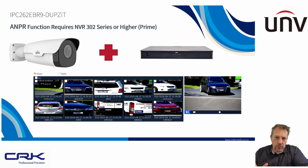So if you've bought a recorder in that sort of time scale and it's a 302 series, the chances are it will be a B model. You can also use the 304 or 308. The reason for that is those recorders have the database function built into them, and that's what we're going to be setting up and configuring when we use the ANPR camera, as you can see.